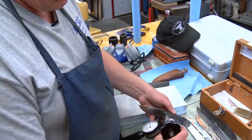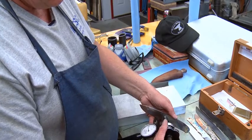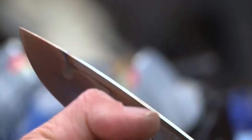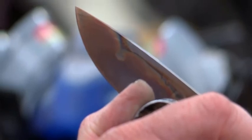So I put it on there. I'm finding a good flat spot. I put it in there. I get it right to a set mark, which is 0, right there. I move this wheel to the acrylic, and then I put the 150 kilogram force on it. There's 150 kilograms. Now I back it off, back to the set mark, to the 0 mark, and I read directly.